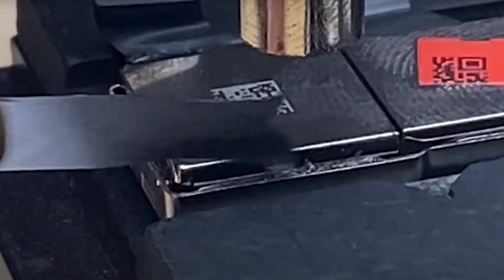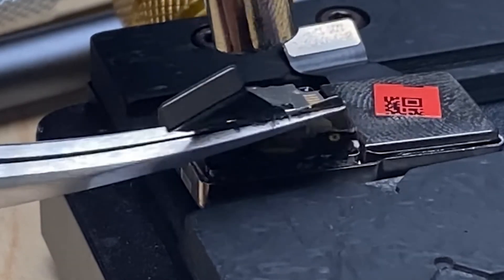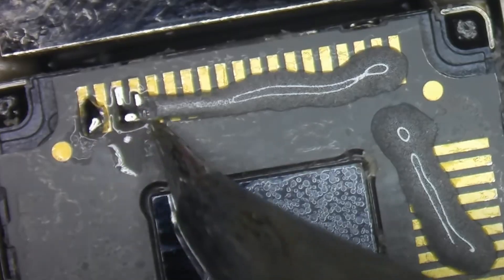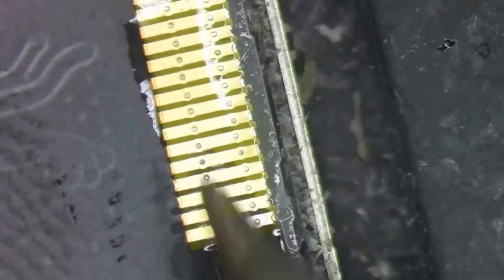In the past, in order to get rid of the notification for a rear camera replacement, solder work was also something that had to happen — whether it was soldering a new flex cable to the back of the camera, or if you were doing a camera repair, you could replace the lens, which requires soldering, and a few other things. So having a programmer like this, along with the I2C components, is making these repairs that much easier.